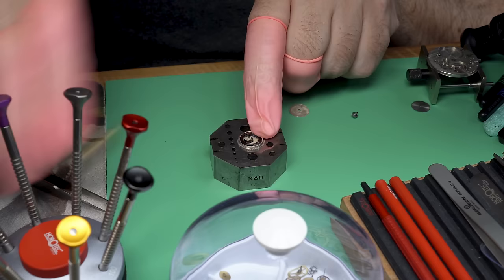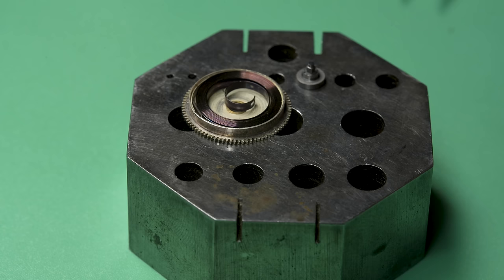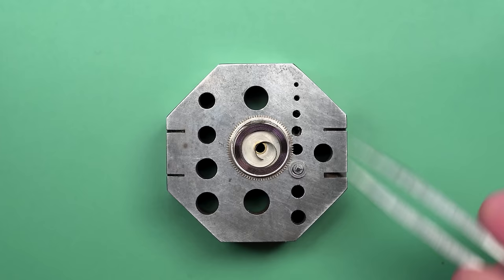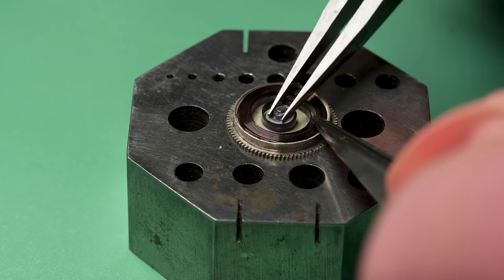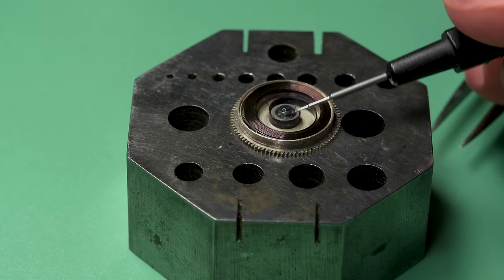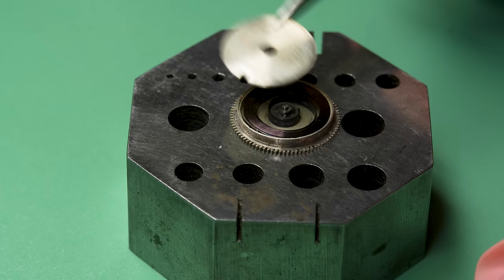After you do get them, you get to hear that sound, which is fantastic. The edge is sticking up a little bit, but I'm able to push it back down with my tweezers, and that means we can continue with the rebuild. The barrel arbor will go in first — this is all normal, very much in my comfort zone. If you watch my videos a lot, you've seen me do this before.